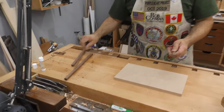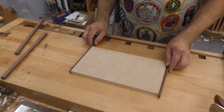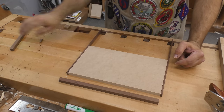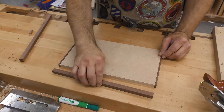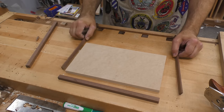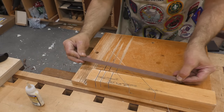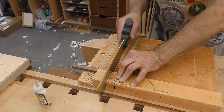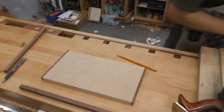There's our core. I'm going to use three-sixteenths. I had some leftover walnut from that same board so it's going to have the same color. We'll glue these two pieces on like this, flush them off, and then glue these two pieces on. Not nearly as much on the side, but in case I want to do a wood hinge on this I want to have plenty of material. So the back band and front band are going to be a half by half, and the ends are only going to be three-sixteenths. I prefer to cut these with a cross-cut saw and my bench hook, as opposed to running to the chop saw or the table saw. These have to be done first.